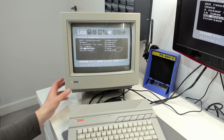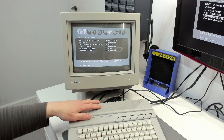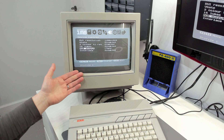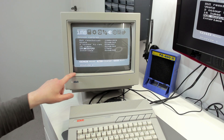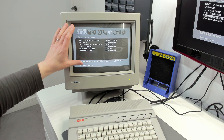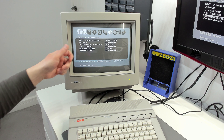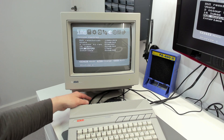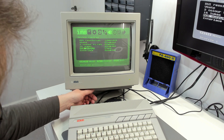They're all basically the same monitor internally. Someone actually managed to have this monitor working with a stock 8-bit Atari with chroma and luma video by putting Philips or Commodore monitor guts inside one, which was pretty cool. But now we can have it with RGB, which despite the flicker on screen — I can't sync this camera with a PAL CRT signal — is actually very sharp and very nice. The scan lines look really good. I think we might have a little bit of a geometry issue, because one side of the picture is higher than the other. There'll be some setting inside where you can diagonally twist the picture. All we've got in the front is contrast, brightness, horizontal position, and a green screen switch.